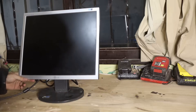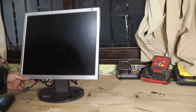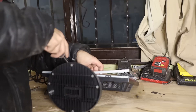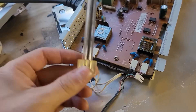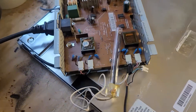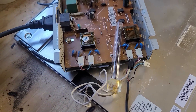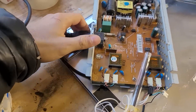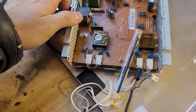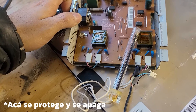The third monitor made me feel a bit sorry. The monitor would turn on, but a second after displaying the image, it would turn off. I started to disassemble it, and when I opened it I realized it had already been disassembled before. When I disassembled it a bit more, I saw that inside the monitor they had left an ultraviolet light tube — something ridiculous. The monitors have a system that detects if any light tube has burned out, and if this happens they turn off to protect themselves. In this monitor, one of the tubes burned out, and far from replacing it with an original spare, they put an ultraviolet tube inside. This is so that the ultraviolet tube consumes energy and simulates that the original tube was replaced, even though it wasn't.